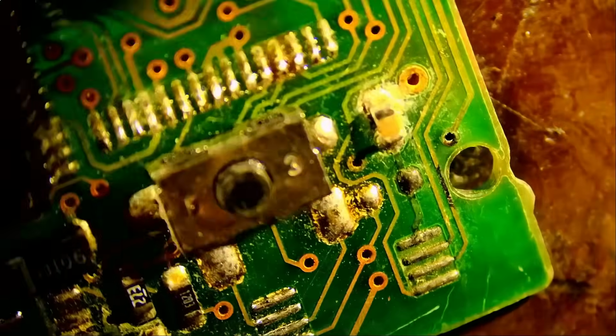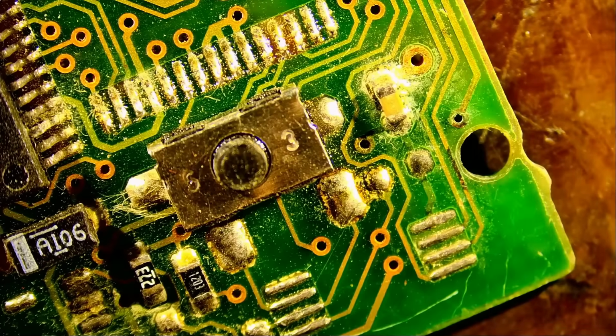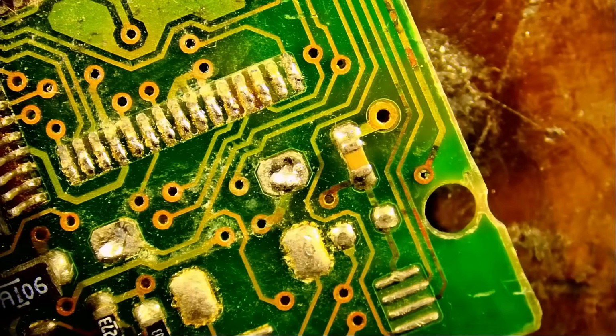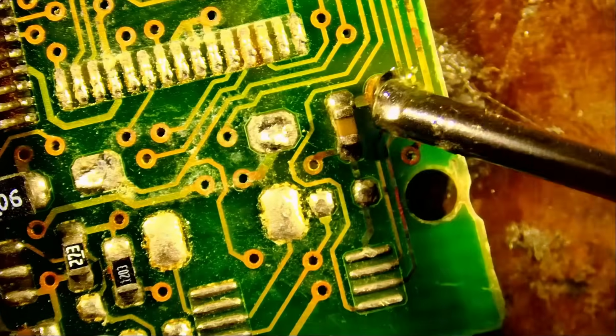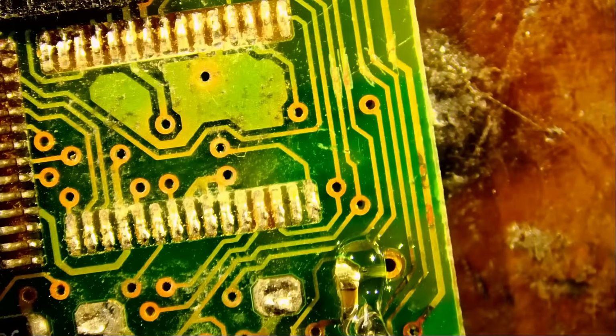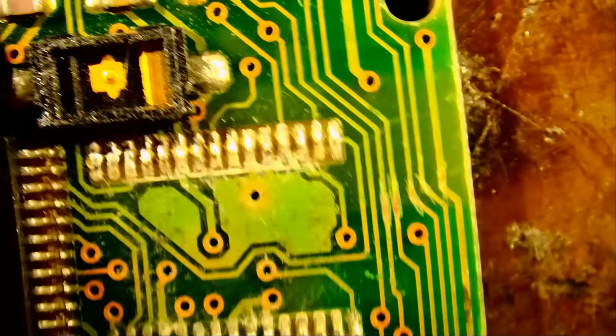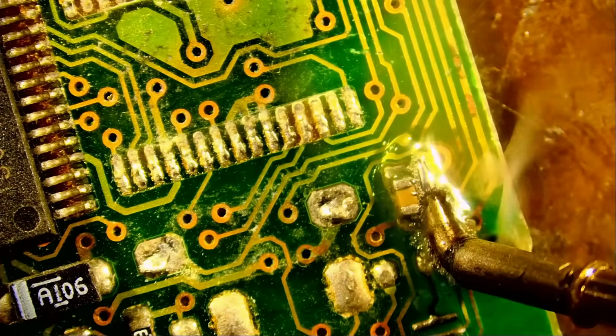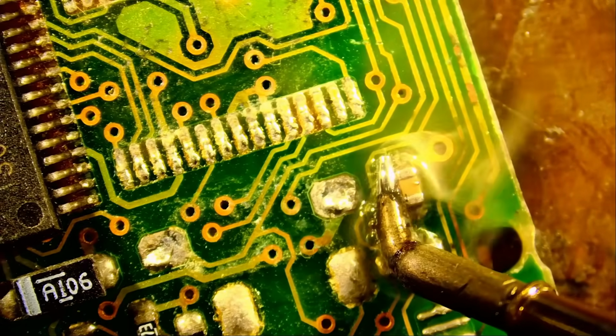So let's see if we can grab the capacitor from this one. Do we have the capacitor here? It looks like I used the cap from this board. What about this one? We do have the cap on this one. The board is a bit dusty, but the cap is good. What about this one? Let's use this one, okay? Now the cap we can remove with our hot air station, or we can simply remove it with our soldering iron. We are dealing with a 2-layer board, so it's not a big deal.